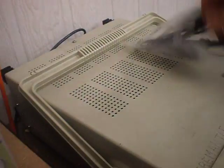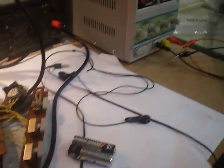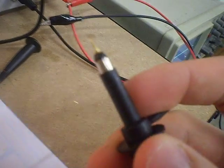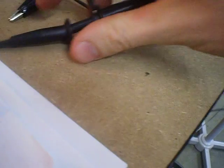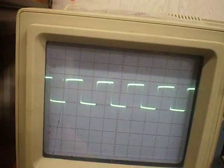I'll just set a probe up. Bear in mind, I don't know an awful lot about these, so I'm kind of figuring out how it all works. Here's one of the probes — just cheapies off eBay, but they're good. If you pull down on this, you get a nice little metal hook you can hook onto anything. If you flip that off like a pen cap, you get a little probe, and then here you've got a little alligator clip. I'll connect this up to the calibration hook on it, which is 2 volts — just for testing it.